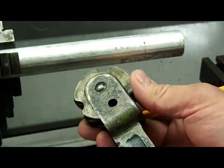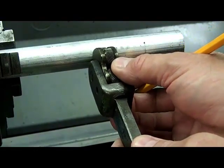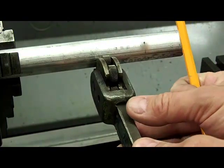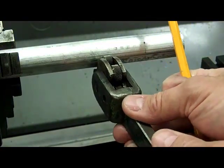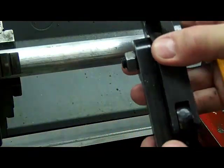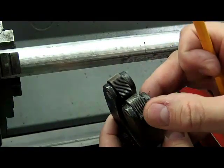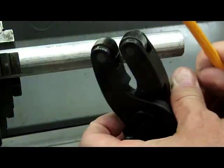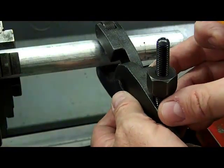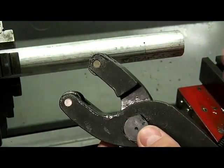I don't like to use this particular tool because I'm pushing on the front of the shaft, so as I get further away from the chuck, it tends to want to bow the part in the middle a little bit. So I typically like to use the other style knurling tool, which holds onto the tool post also but only has one set of wheels. What I'll do is open it up like a pair of scissors and put it over and under on the shaft. This tends to neutralize the cutting forces and doesn't push the shaft away.